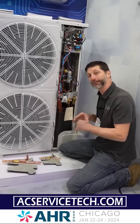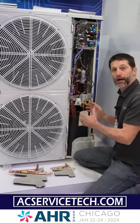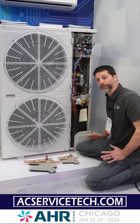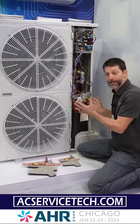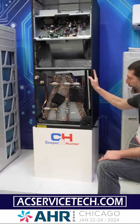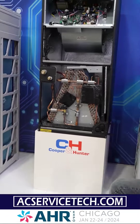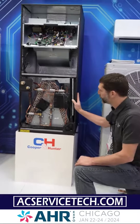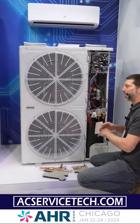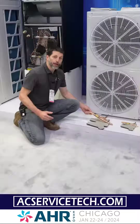It's just one run and you branch off as you go. You're going to have this be able to connect up to 11 indoor units, and you can have a total line set length of up to almost 400 linear feet cumulative. Another key difference is that at each of the indoor units — such as this air handler right here — you're actually going to have a metering device at the indoor units, which differs from a multi-zone mini split.